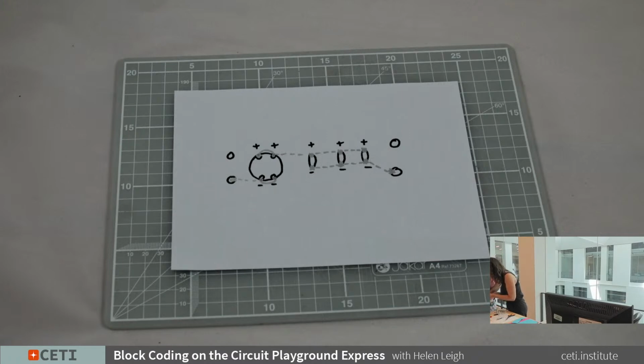Exactly correct. And this is just going from switch, correct? And that's not attached to anything else, just switch. And this is just attached to ground. Right. So then you want to just turn it off. Then you want to connect these three ends together with conductive thread, with nothing else, and they go to a snap here. That snap will connect to this one. So this is grounding, then sew it all the way down, and then a snap. Perfect. And then with regular thread, sew these four ends. You've got it.